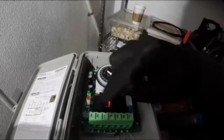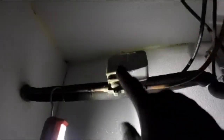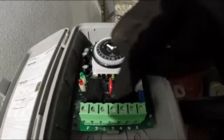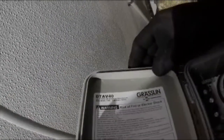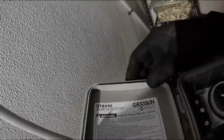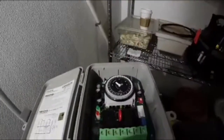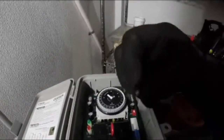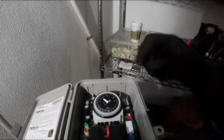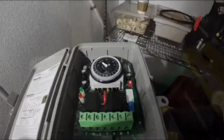I don't mind using these when we're just putting a load of a solenoid valve through the electronic contacts — they're rated up to 40 amps, so you could actually put your defrost heaters through there on your freezer. Normally on that type I like the old Paragon timer with the big metal contacts.